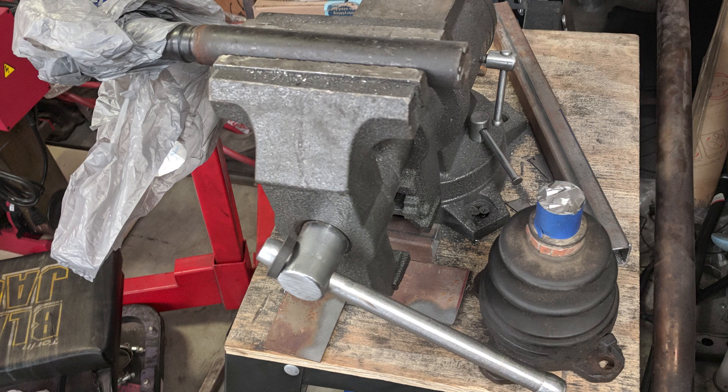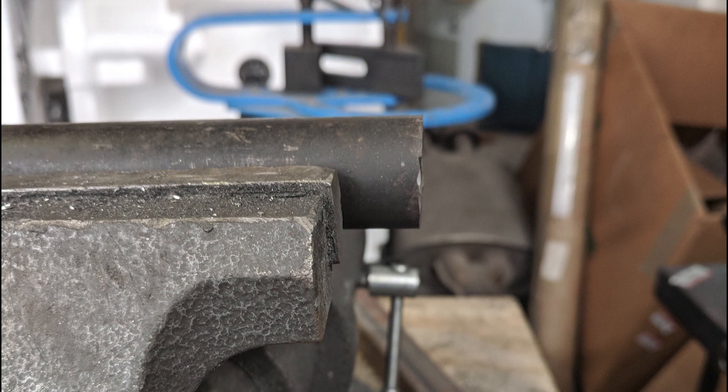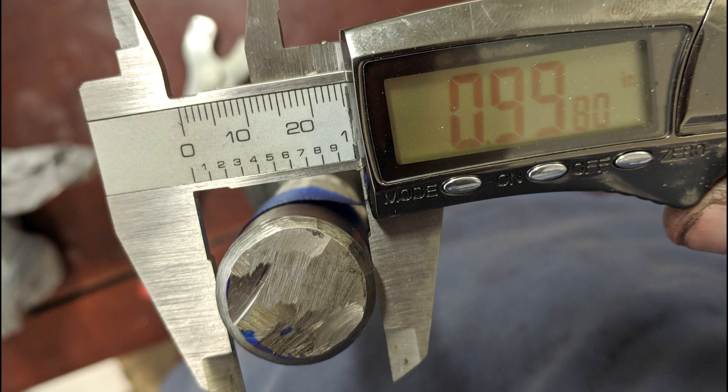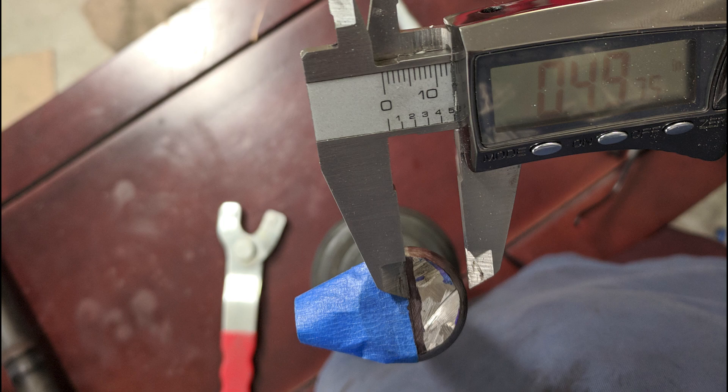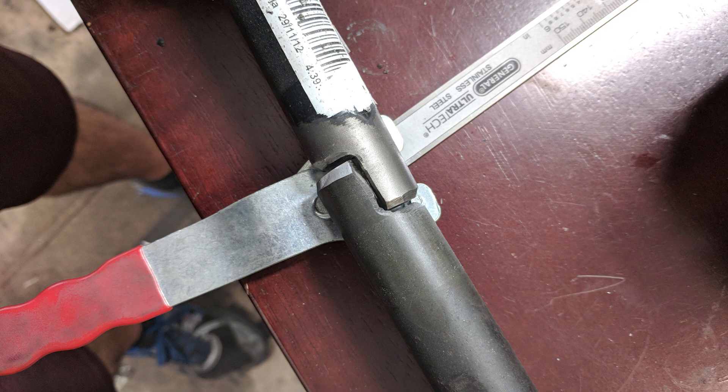I went ahead and took an angle grinder and cut this down. I didn't have a bandsaw at that time that could make this cut straight, so I went ahead and cut it as straight as I could, made sure it was at 90 degrees. We went ahead and beveled the edges. Now we're down to 0.998 inches — really, really close. I went straight down the middle with this and made basically a stair step, and I'm at 0.4975 — pretty close with an angle grinder. Now we're going to be able to lock these two together, so even if the weld on the inside breaks, when we have a sleeve on this, we're going to be able to hold those two pieces in place and lock everything in.